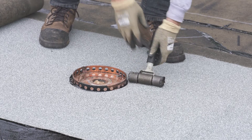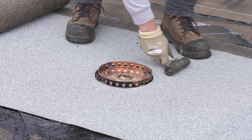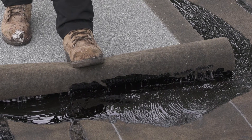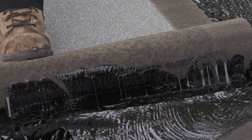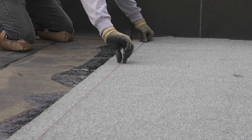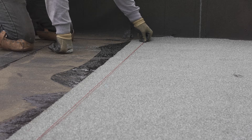If necessary, use the membrane roller around the perimeter of the drain to ensure complete and uniform adhesion. Before resuming the bitumen application, pull the roll lightly until you see bitumen strands. Once the first roll is installed at the drain, make a chalk line over the granulated side lap to create a 75 millimeters or 3 inches wide selvage.